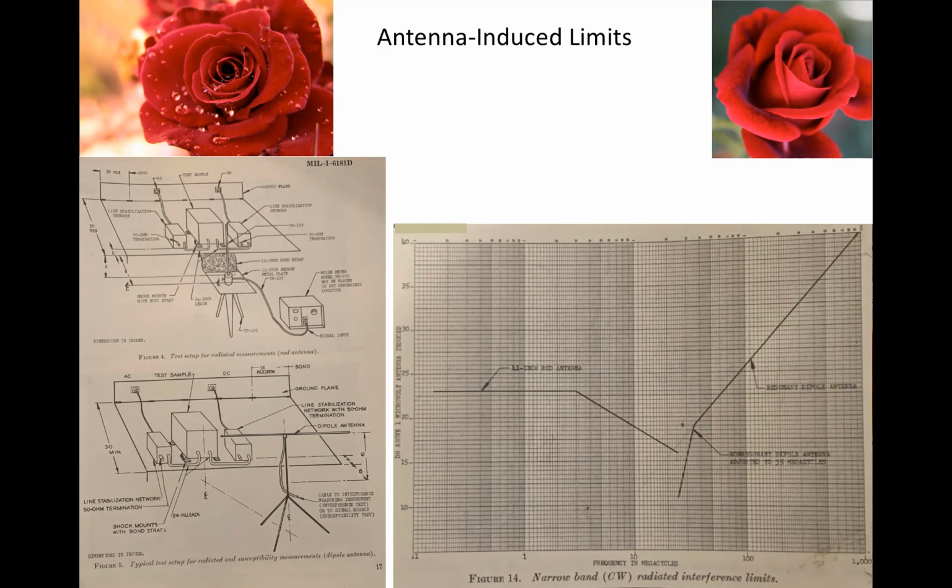When they backed antennas up to 1 meter separation in the mid to late 1960s, that was when they transitioned to a field intensity limit. An arbitrarily defined new antenna factor was tacked on in order to express the limit as a field intensity rather than an RF potential. Hence, the original 1968 release of ARP-958. But this change was still encumbered with all the caveats and limitations described for near-field measurements in the previous slides.